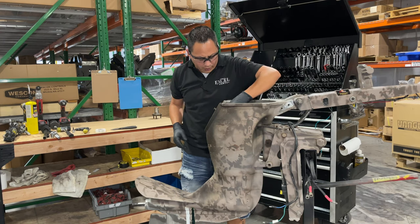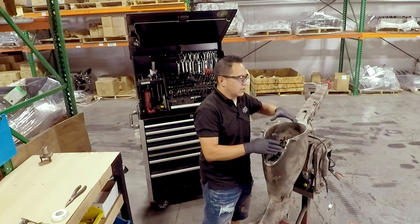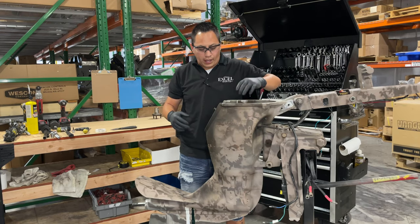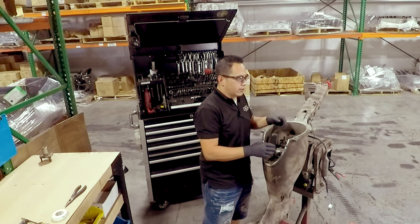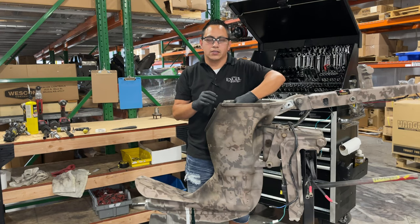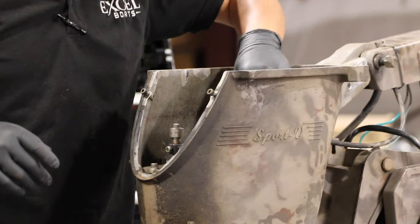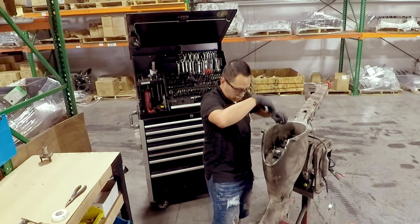Okay, back here, up here in the middle section, this is the access cover. This is where everything happens. All the moving parts are. You have your shift linkage, you have your engine and transmission linkage, you have your neutral start protection circuit, and your switch. You do have the vent. Some of you have a vent, some of you have a bellows, which is this little black part. Once you remove this bellows, you actually open the ventilation for the transmission.